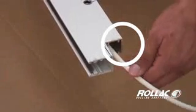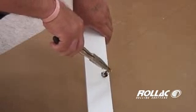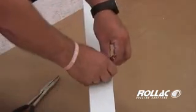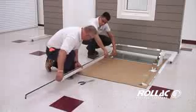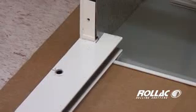Feed the motor wiring through the railing, ensuring to use the enclosed box inside the rail. Use a pair of needle nose pliers to pull out the wiring through the drilled end. Be cautious not to accidentally cut the wire against the drill hole.